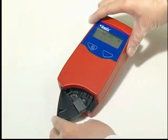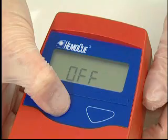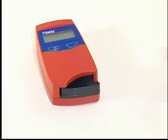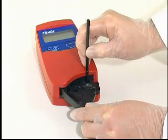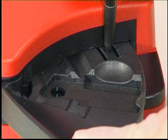The analyzer is designed to work for a long period of time without any direct service or maintenance. The analyzer should be cleaned according to the following procedure. Check that the analyzer is turned off — the display should be blank. Rotate the cuvette holder out to its loading position. Use a pointed object or your thumb to carefully depress the small catch positioned in the upper right-hand corner of the cuvette holder.